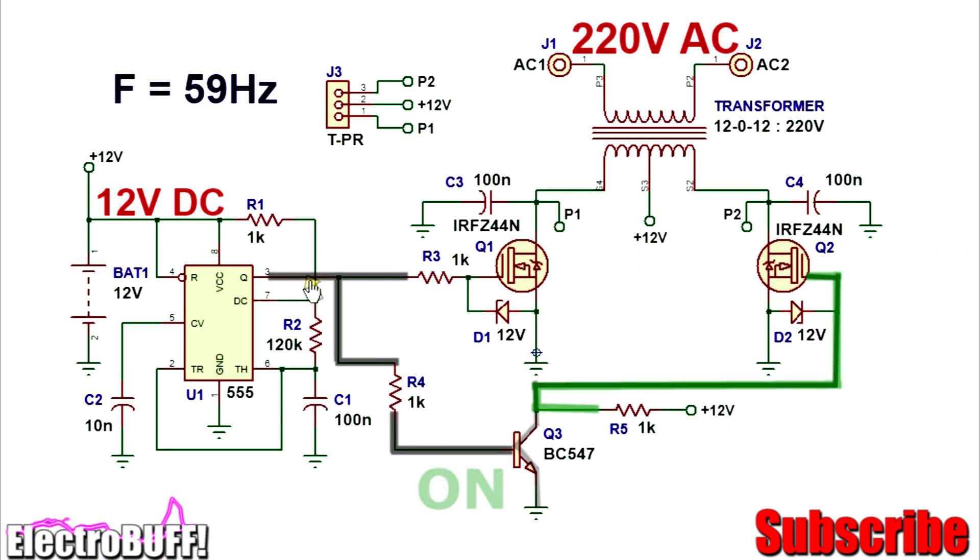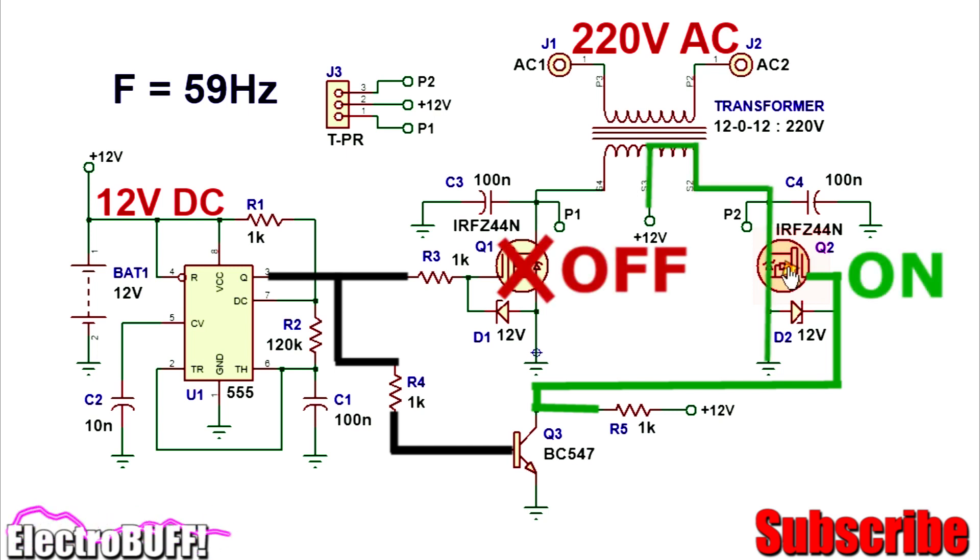After some time, the output at PIN 3 will go low, and so cause the MOSFET Q1 to turn off. And because we have a low input here, the transistor Q3 will also turn off, and because of this resistor R5, there will be a VCC reference of 12 volts at the collector of the transistor Q3, and this will pull up the gate of the MOSFET Q2 to VCC, causing it to turn on. Current now flows from the 12 volts rail through the winding S3, S2, through the MOSFET Q2 and to ground.